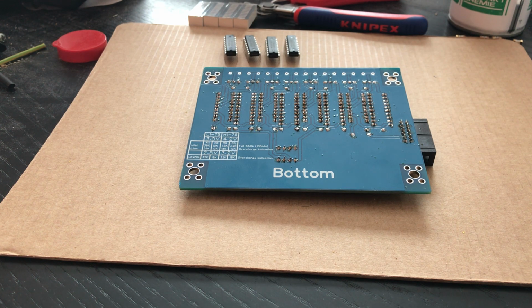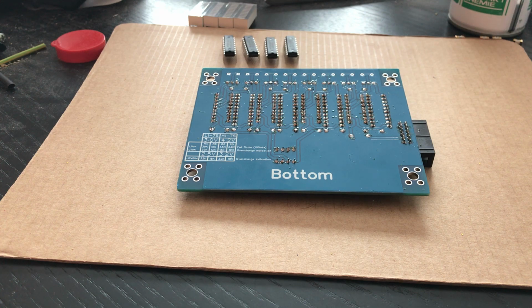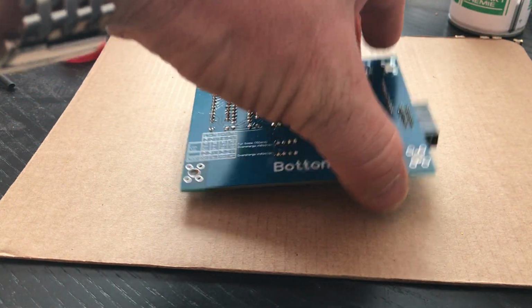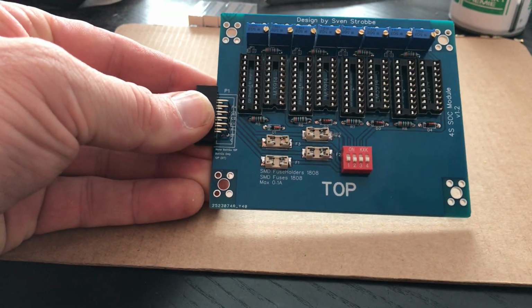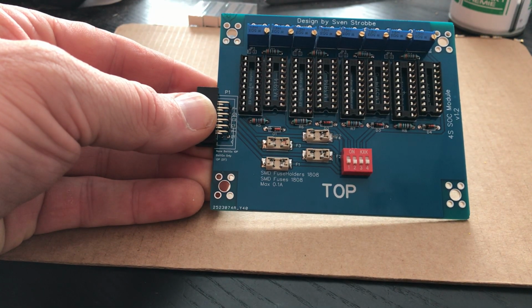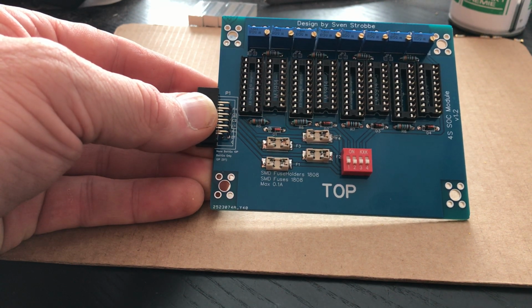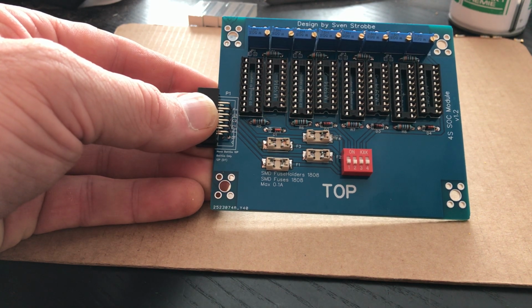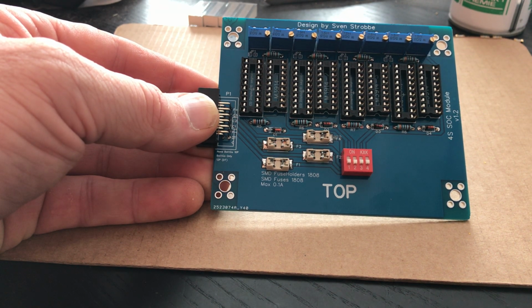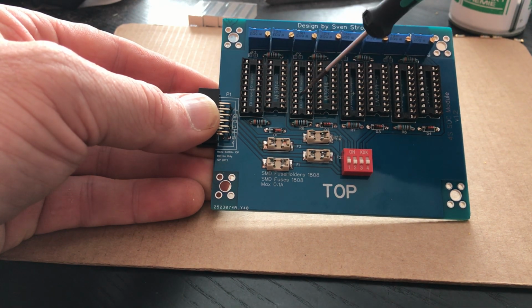Okay, here we are again with a follow-up of the previous video. After having soldered everything on the board, as you can see now, everything is on there, the fuse holders, the dip switch, so I will resolve it again. The first thing you have to do is put on the IC sockets, or the foot for the LED BarGraph and the IC. This is this piece here. These.